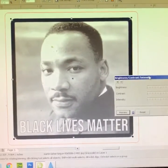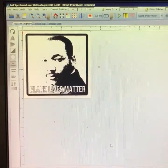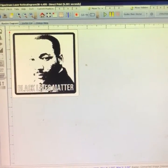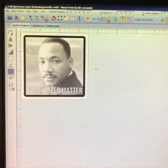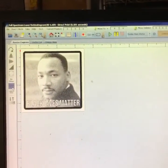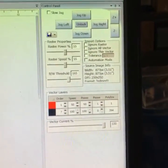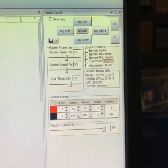I know it's hard to see and I apologize for my shaky hands. But next we're going to send it to print. Now we've got our Full Spectrum software. We're going to change the setting here for simple dither, and then we're going to press play. Power setting, I've got it about halfway — 50-50 — pretty much down the board for the raster and the vector.